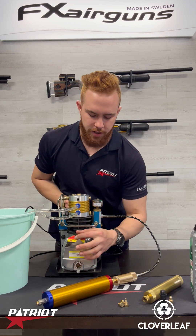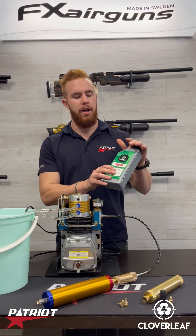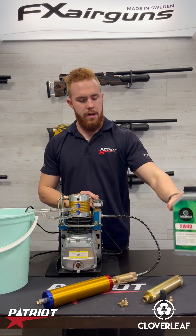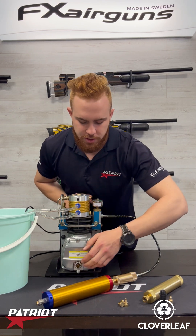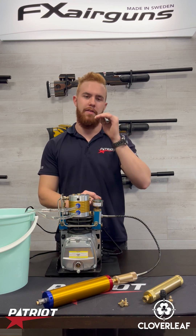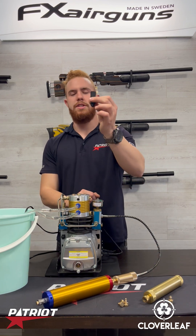There's a cap at the front — that's where your oil goes in. We sell 5W40 clear relief oil which works best in these compressors. You'll literally only need a quarter of the bottle to fill your compressor up. Take your compressor oil and pour it in. You'll see the reservoir at the bottom has a red dot in the middle — it's an optical valve. Fill it just above the red dot and your oil compartment is filled and good to go.